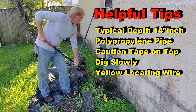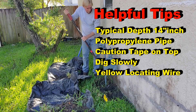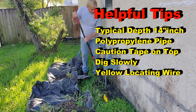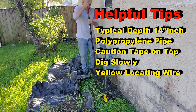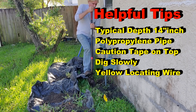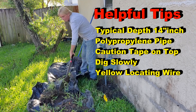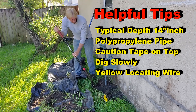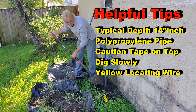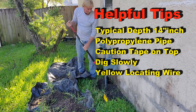The pipe is usually polypropylene — that's a plastic pipe and it's very strong — but the point of a shovel, if you hit that plastic, you're going to hear it; it'll definitely pop that line. So just be very careful as you dig. If you're digging in a rooted area like right here, you've got to be even more careful because you don't know what that is — it could be a tree root or it could be that pipe. Just take your time and dig slowly.